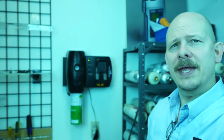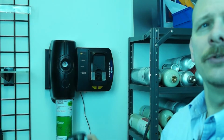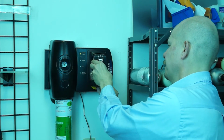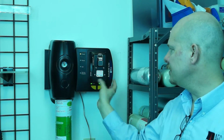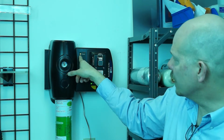I'm going to go ahead and pan in a little tighter, and now I'm going to go ahead and do a bump. So all I'm going to do is take my meter. It's turned on. I did a fresh air earlier on. Take the unit, put it face first towards the unit, and slide this jaw up right here on the unit. So now the instrument is contained in here. I slid this little connector holder piece for the instrument upward, and you'll see the green power light came on.